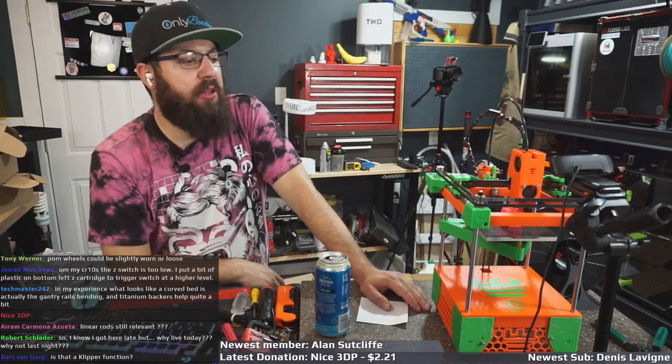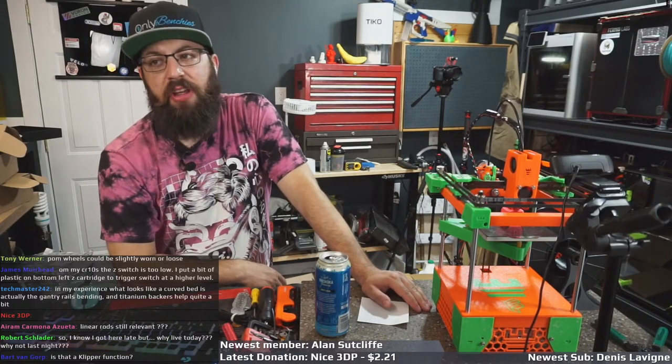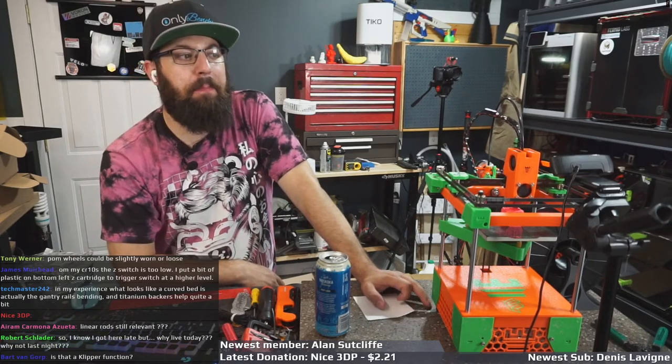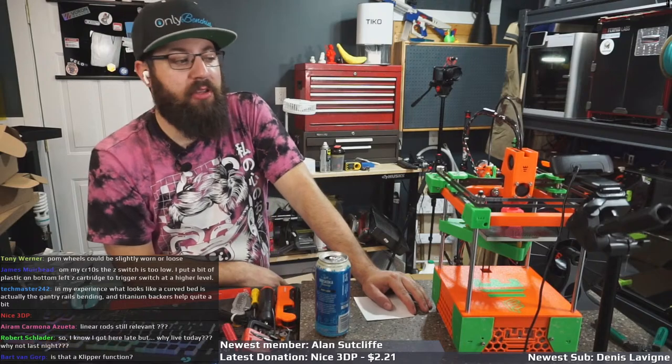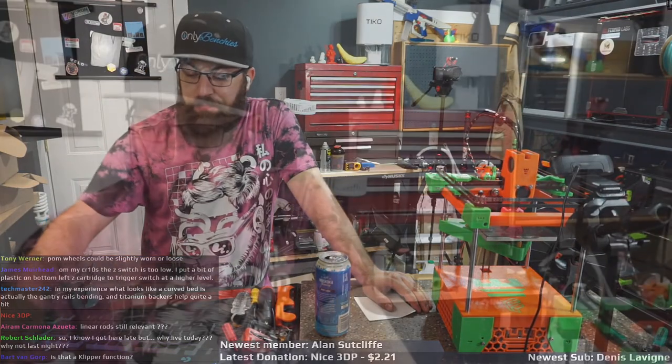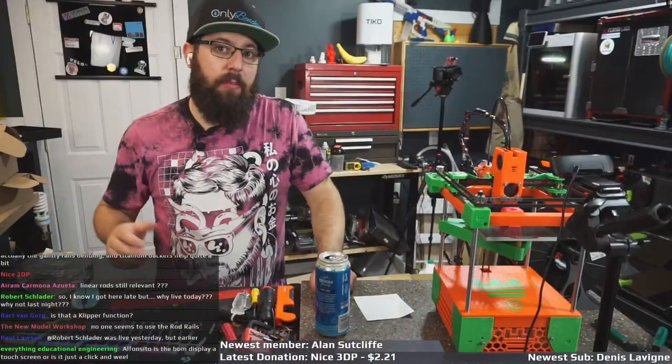A curved bed. Yeah, that's another thing. You could have a twisted gantry. I have a video on my channel about twisted gantries. And that is something that plagues V-wheel bed flingers, because regardless of what anyone wants to tell you, extruded aluminum is not a precision thing. It's literally extruded aluminum. They take aluminum and they force it through a die and it comes out in a shape. It's like Play-Doh. Remember that Play-Doh thing when you're a kid, where you put the Play-Doh in and you go squish and it comes out in a moon shape? Yeah, that's how they make extruded aluminum.